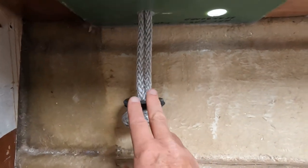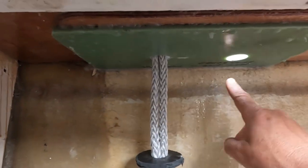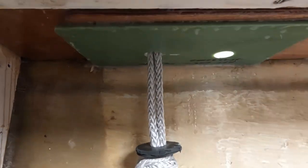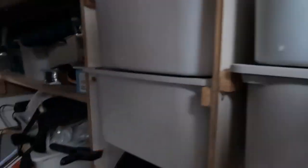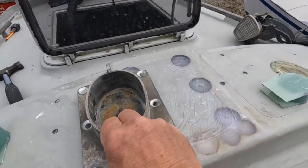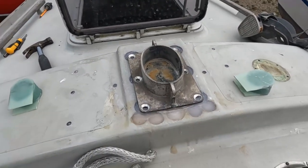I've got at the moment four of these to put in the aft cabin. They go close together - that's the cap shroud and that's the lower. I've drilled the holes on this side and got to drill the holes on the other side. Let's go on deck and have a look at how that looks in practice for attaching the rigging. I've now done the fiberglass and thickened epoxy on top so that's ready to be through-bolted.